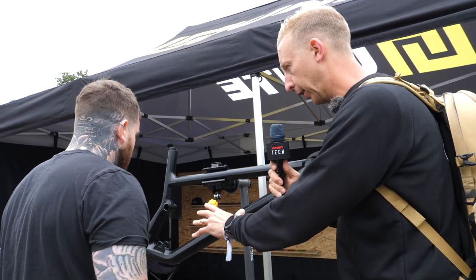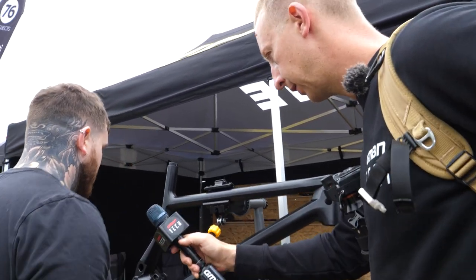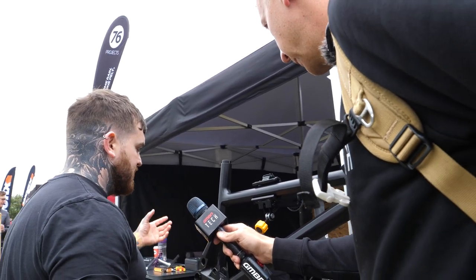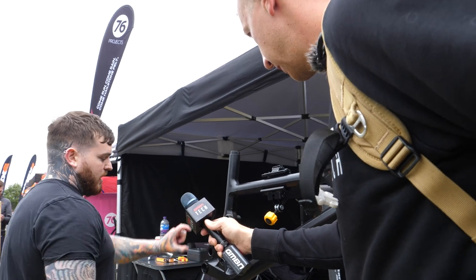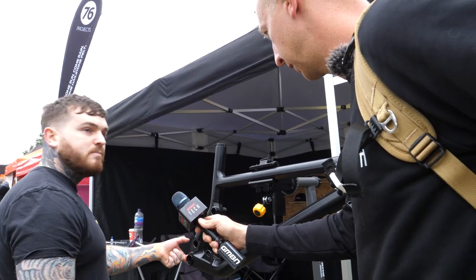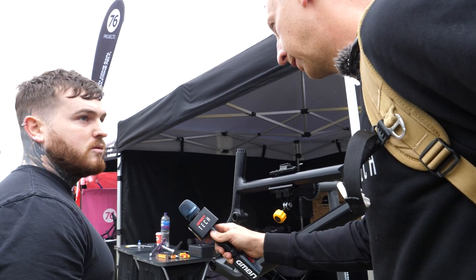What's the deal with the back end of the bike? It's a trunnion linkage, still in development, fully designed. That'll be CNC machined on the back — imagine an arm coming out there, and then your rocker. There's a brace in there which is bolted in. This will all be anodised as well, so it won't be painted.